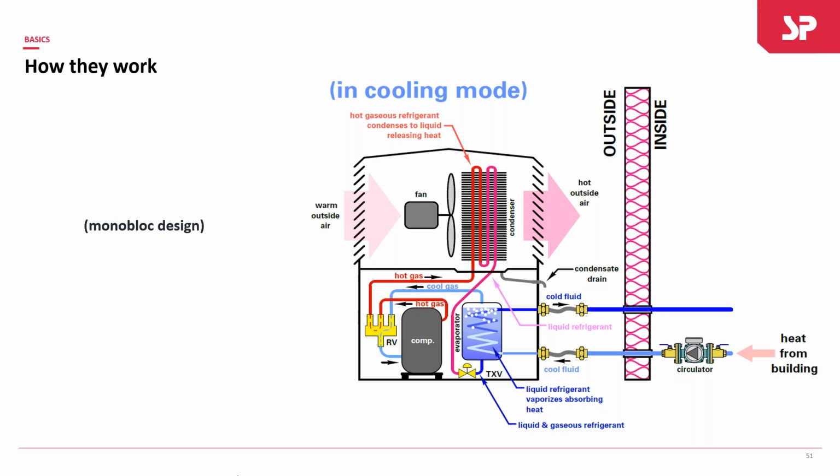Now keep this in mind. I'm going to plant another seed, antifreeze, right? We're going to talk about antifreeze quite often. What are the two things we have going on out here? We have water or a water glycol mixture going outside of the heated or conditioned space envelope of the house. And we have an exchanger that's got super cooled refrigerant on one side. The need for antifreeze in every single SpacePak air to water heat pump is mandatory, right? Mandatory from the fact that we say it is. If you choose not to use it, that would be on you.